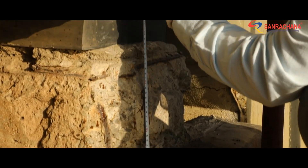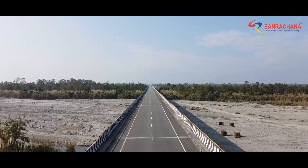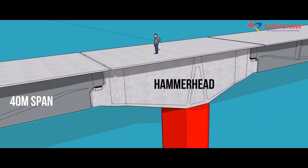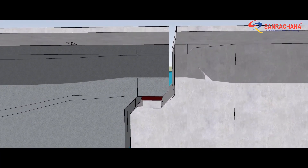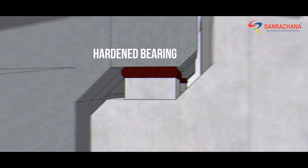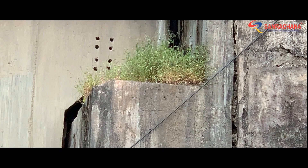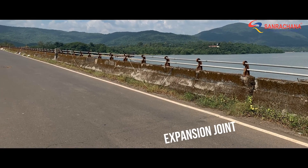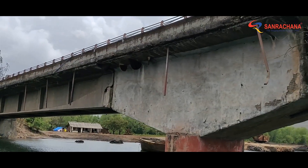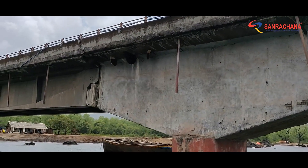The second problem was in energy dissipation. These discontinuities called expansion joints are the gaps separating the spans from the hammerhead. In the course of time, the bearings hardened and became incapable of damping the vibrations, and expansion joints got filled with vegetation, dirt, and asphalt, making the whole superstructure behave as one long unit of concrete.